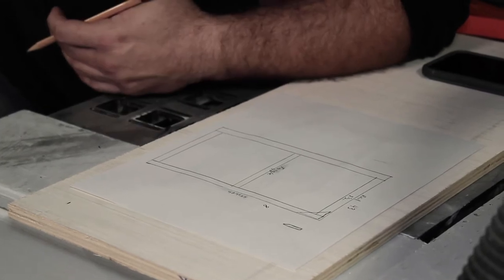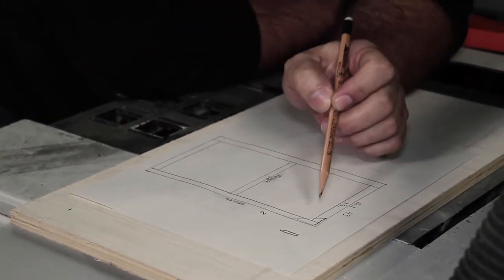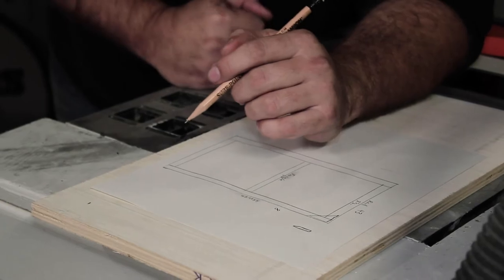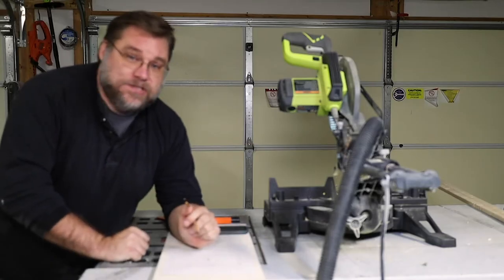We're going to use pocket hole screws. Now the last thing that's going to be different about this is this top rail, we're actually going to put a 45 degree angle on because that's going to serve as a French cleat to hang the flats on our wall.